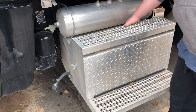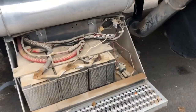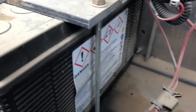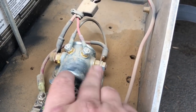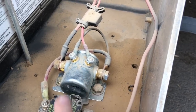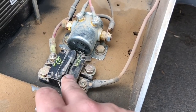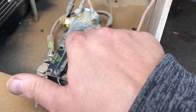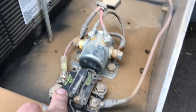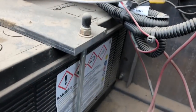There you go - look at that dirt. This is my 150-amp circuit breaker and it's waterproof. You can see the moisture and dirt that gets in these battery boxes. This is the solenoid - just like a Ford starter solenoid. It runs off key-on ignition, so when I turn my key on the solenoid switches over and supplies power to my circuit breaker. The 150-amp circuit breaker is carrying the load - it's just switching it on. I've got a solid 12 volts coming to this, a ground signal, and then my power supply to the circuit breaker, and then out of the circuit breaker I ran my wire back to my plug.